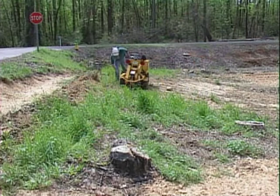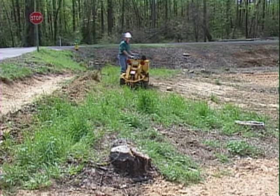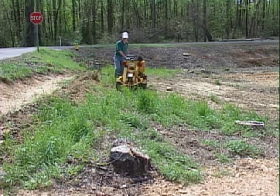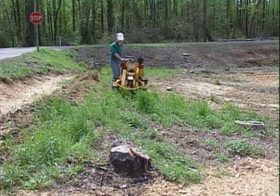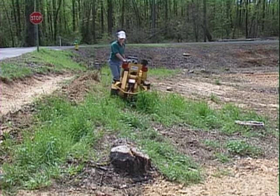When you move a self-propelled stump cutter over an area of poor traction or uneven terrain, it will help to have both drive wheels engaged. This will improve traction and reduce the chances of sudden, unexpected turning. However, it will also make the machine harder to steer. Use good judgment in these situations.